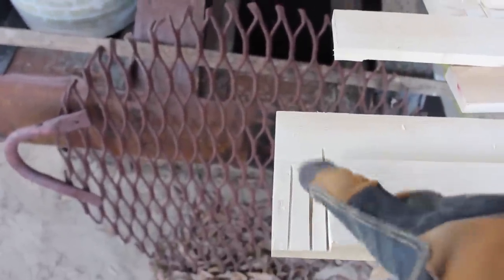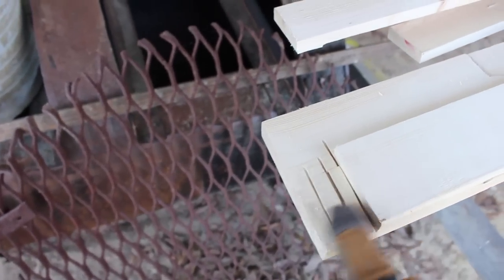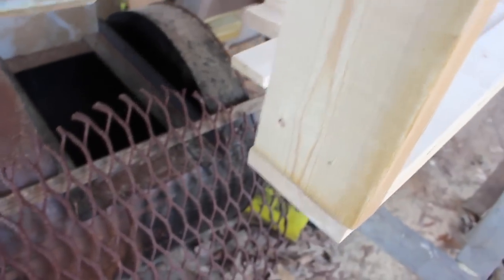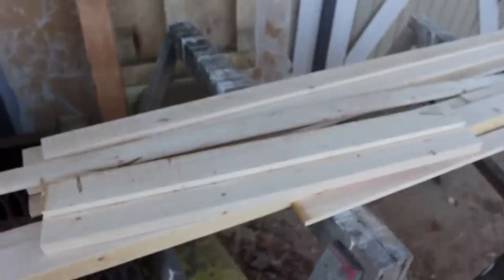I took my skill saw - it rolled over the edge and dipped in just a little bit deep, but that's not going to hurt anything. Then I took a chisel and cut it out real smooth so that when you put these two pieces together it looks like this from the top and like this from the side. That creates a corner right here - I'm going to wood-fill that corner. When you put these together they form the door casing to go around the door.